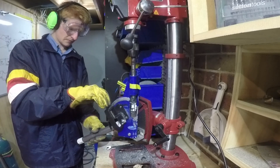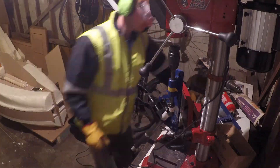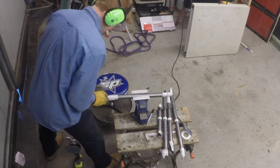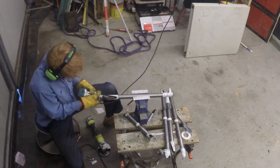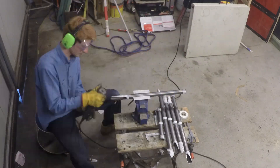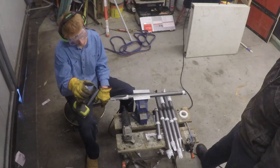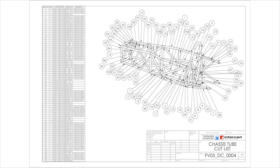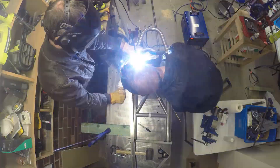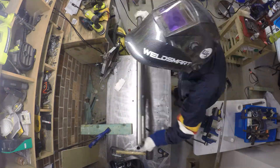The process of cutting the tubes took a very long time. I cut some on weekends, some in the evenings in my garage after work — in batches so that I could start getting the chassis together. Any tube with a very shallow angle had to be cut by hand. I found a combination of hand grinder, bench grinder, and deburring tool achieved the best results. This is a job that can actually be done by specialist laser cutting companies — I got a number of quotes and they all came back at a few thousand dollars, which was a little too expensive for me, though not unreasonable if you're short on time and want better accuracy. I did have the roll hoop bent by a tube bending specialist, as we just didn't have the tools or skills to do that ourselves, and the price was very good — only a couple of hundred dollars.